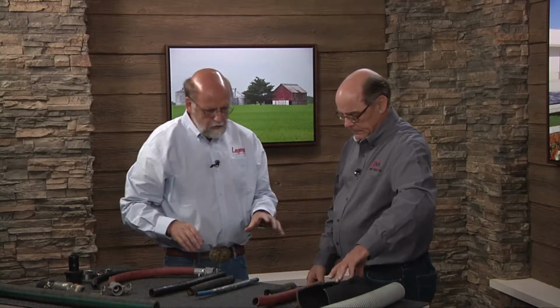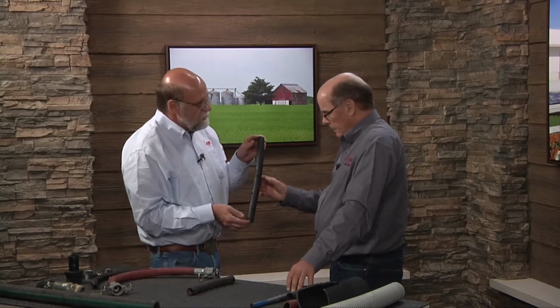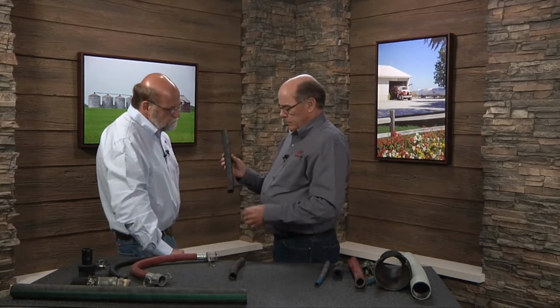So we've talked about sunlight, we've talked about abrasion eating the cords and the casing that we have. Now let's talk about the damage that petroleum type products can do to rubber. This is the perfect example of using the wrong hose with the wrong product. We mentioned the fact that for most ag chemicals, EPDM is a very good product. Petroleum-based products do not like EPDM rubber. They will literally just soak into it and saturate the hose. You could take a hose like this one and it would start leaking through. Even if it didn't burst completely, it's just not a compatible product to the petroleum industry.